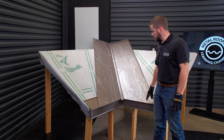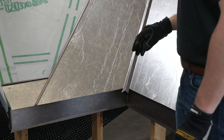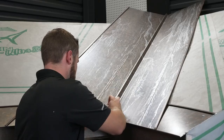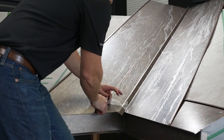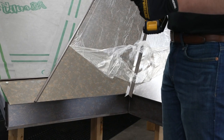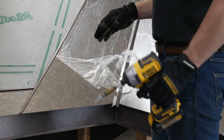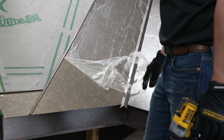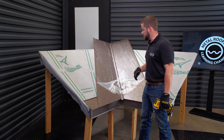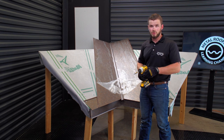Now that we have the valley pan on the roof, everything's lined out, our corners are good. I'm going to peel the plastic off this, put a couple screws in it to keep it in place, and then I'm going to address the W of the valley. Now that I have this first section peeled, I'm going to pin the bottom to make sure this thing doesn't go anywhere on the roof, and then continue peeling the plastic the rest of the way up. Some people like to score the plastic with a square and leave the plastic in the valley — in this particular case, we're just going to peel the plastic and then install our panels all the way up.